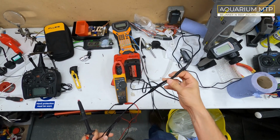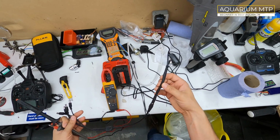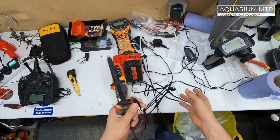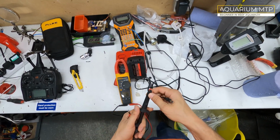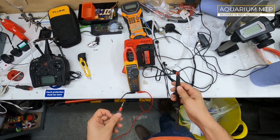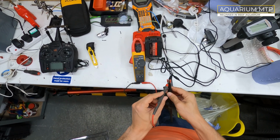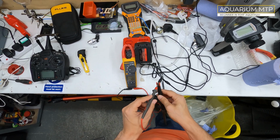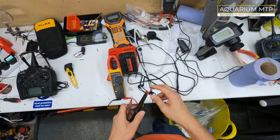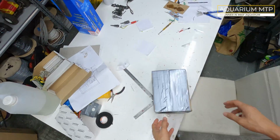that was accidentally cut, so I had to redo it, and it's so straightforward to just join two cables together that it didn't really cross my mind that I might do it the other way around. So if we measure the voltage now, it gives us minus 12.3, and that was probably the reason why the pumps kept spinning. So let's have a look now.